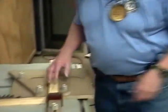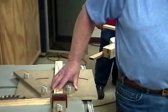The way that we're going to cut this one is what they call grain matching. And that is that the grain will always be going the same direction when you look at the edge of the ring around. The cheap way, and that wastes some wood, by the way, especially if you're cutting the rings that I do for the yarn bowls. Anytime that you're doing the grain matching, you have to trim off the end. I'll show you what I mean when I actually do the cut here.